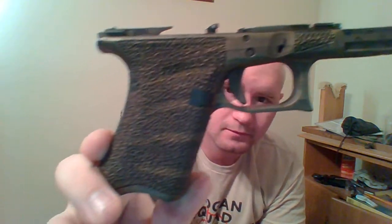Back to the frame — it's a stock Gen 4 Glock frame. You can tell by the bigger magazine release. The finger grooves have been removed, there's an undercut, and it has a stippling job — this was the stippler's first job, so if you know what to look for you'll spot imperfections. The grip has been reduced to Glock 19 size, and it has cutouts so when I get a stuck magazine I can rip it out. Glock's intent for those front cutouts was probably so you can rip it off your belt, but nobody releases the mag with their thumb up front — it's always on the sides.